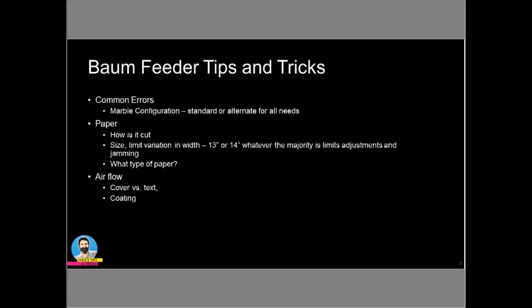There's a separate routine in there to do paper feed timing after you've done it for the whole machine, which requires it to be in the long sheet feeder as well, to do just that. And that requires a 20-inch sheet to do paper feed timing for the longer sheets. That routine is in the system, and I do not have the code for that, but that it is in there. If you go to paper feed timing, you will see for the longer sheets and specifically how to do it just for that feeder. That is critical in both of the, for both of those reasons.